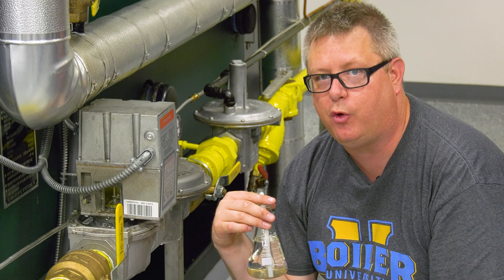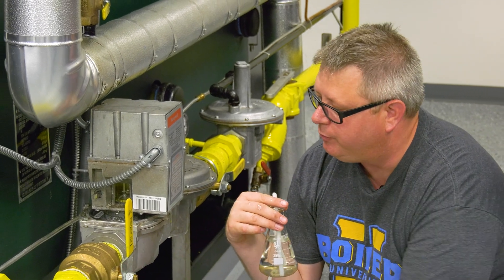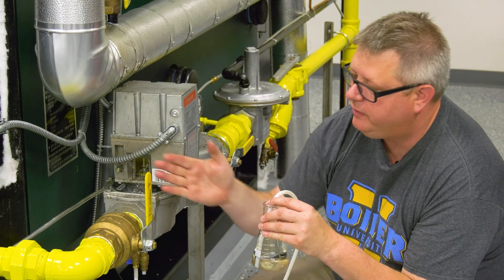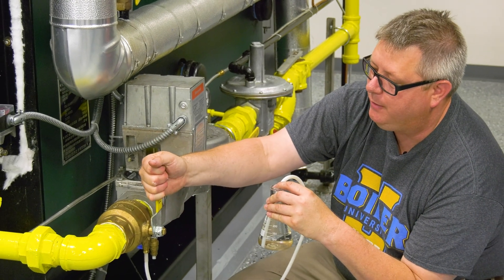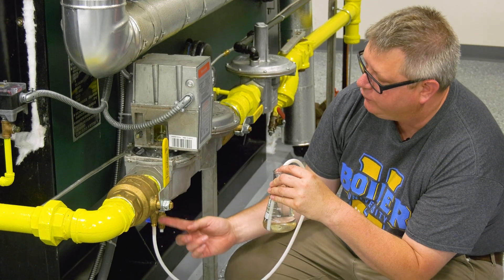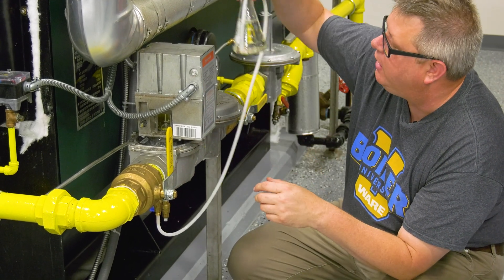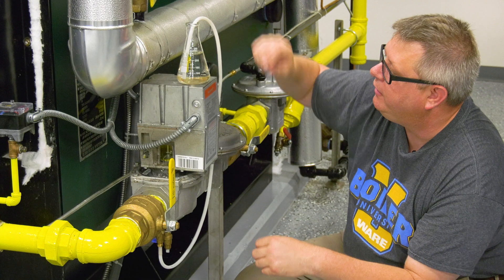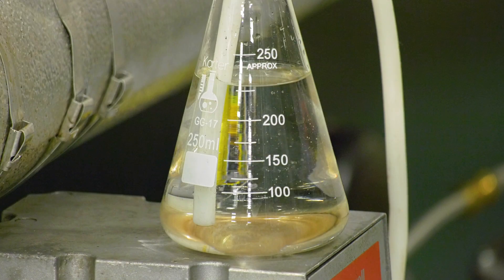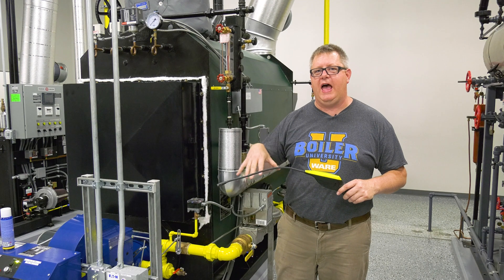Testing a gas valve to see if it's leaking through is a little bit more complicated, because I can't spray the inside of the pipe with soap. What I'm going to do is isolate the pipe downstream and connect tubing downstream of the gas safety shutoff valve. Then we can monitor this — if there's a leak in the fuel valve, we'll get bubbles out the end of this tube and we'll know that we've got gas passing through the valve.